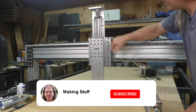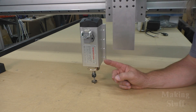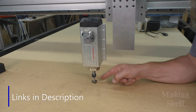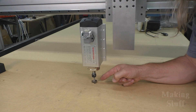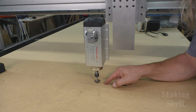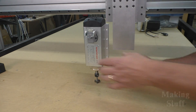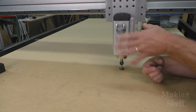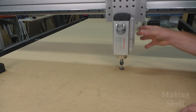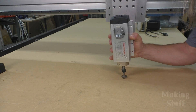I've got the Z-axis mounted to my plate and everything is good to go. Now I need to mount the spindle. This is a one and a half kilowatt air-cooled spindle from Banggood — I'll put links in the description. I've got a pretty wide, maybe three-quarter to one-inch wide bit installed. The spindle will actually stay balanced on this bit, and I'm going to use that as a starting point for tramming. I'll place it up here, let the spindle rest on the bit, mark my holes, and after mounting I can fine-tune and shim it so the spindle isn't leaning left, right, forward, or backward.